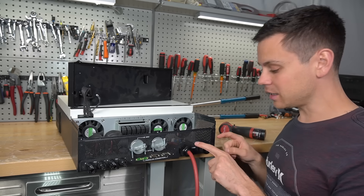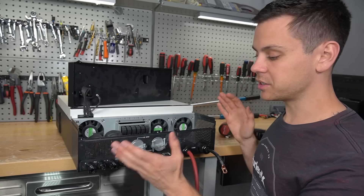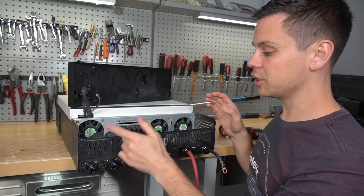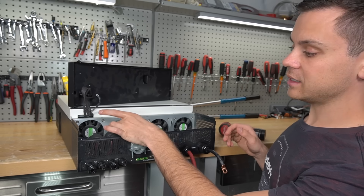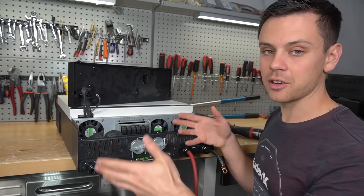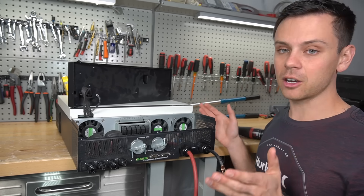If you have a live battery connected to these terminals and you leave the inverter on, these MPPTs will be live. The 6548 is probably the safest all-in-one unit because it has MC4 connectors right here, but there are screws and terminals on the inside that are exposed that could shock you if the inverter output is on. Also, if you have live connections to the AC input and the battery is not connected, again depending on the model, you will have live connections in other areas, typically the PV input. But every model is different.